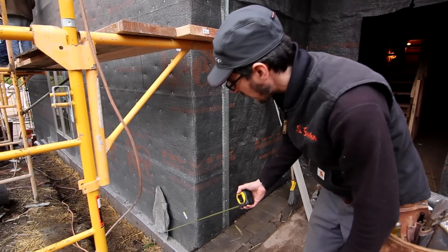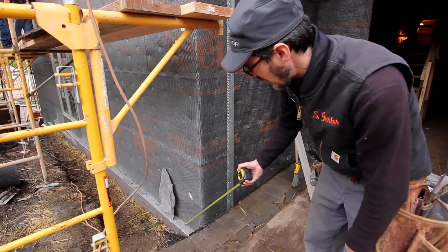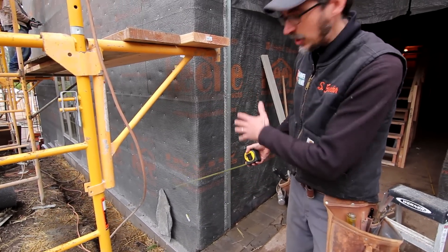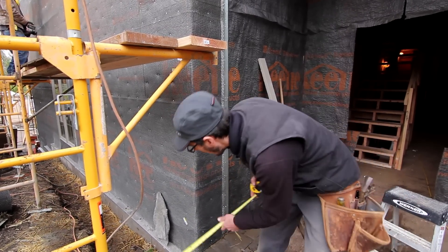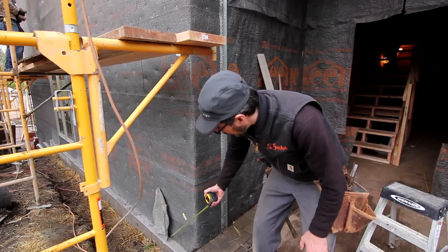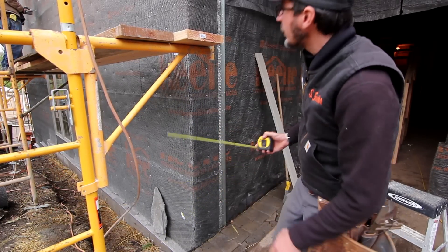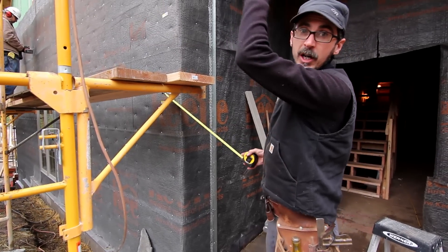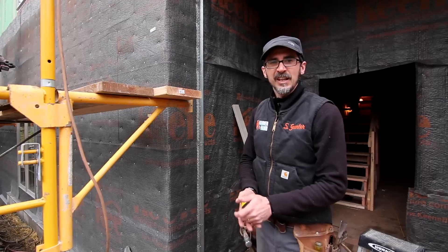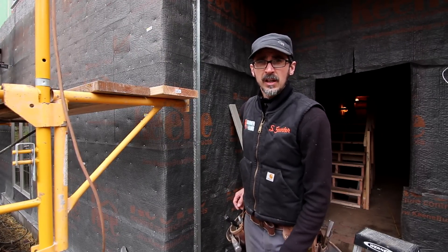Down here, to create the whole drainage plane, I used a stainless steel flashing that has a back leg tying in with our drainage plane — that would be the sheathing. This is essentially our brick ledge, and the stone starts on top of that. We're going to leave the joints open between the stone at the very bottom to allow air movement into the rain screen, and do the same thing at the top so air movement can go out. The whole system is back-vented, because masonry loves to wick a lot of water and water vapor travels through — we need a way to mitigate that.